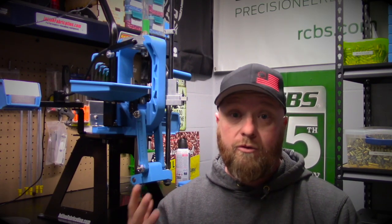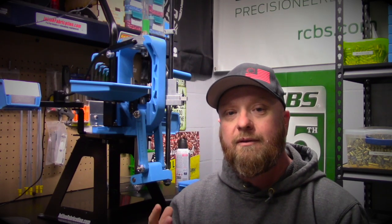The second thing: we are using carbide dies, but I do use case lube — specifically Hornady One Shot. You don't need to, but I do it because this press runs a lot smoother with it. Also, Dillon has a known hiccup from station two — the case expansion — where the powder funnel sticks inside the case. A little bit of lubricant seems to help that out quite a bit. Those might raise some eyebrows, but these are my methods and what's yielded me success along the way.